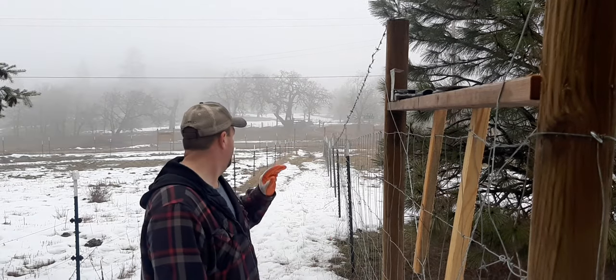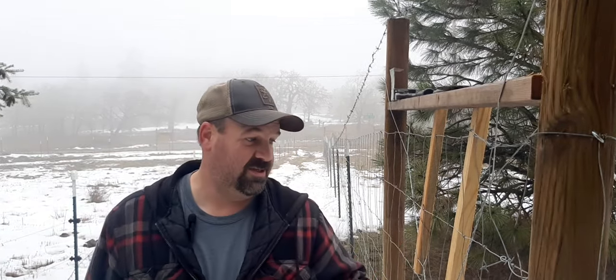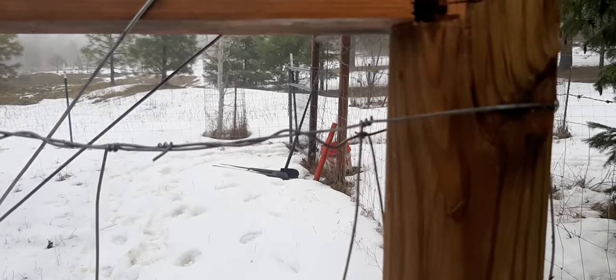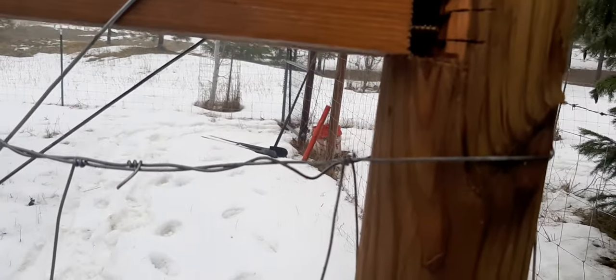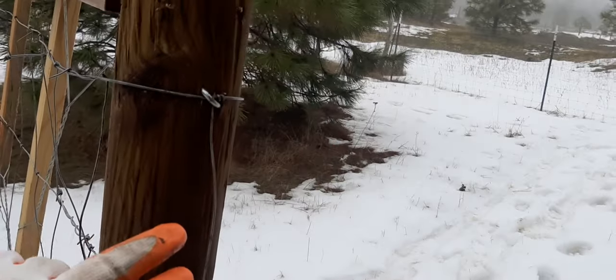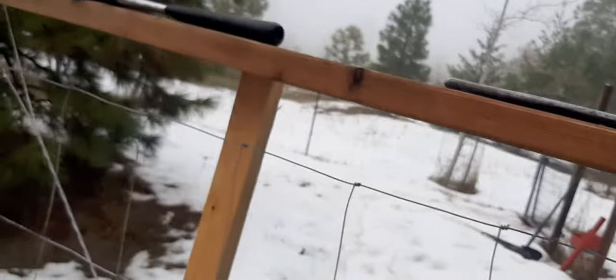Part one's done — rolled all the way down and I just went around my corner. Just to show you what I've done here in this corner: this is how I like to start my corners. I've cut two of these ribs off the end and I just wrap it around all the way down, every one of them. I'll come back later and tighten these up so they look real nice once I get the fence exactly where I want it. I do put a few staples in the end just to hold it as I'm tightening it.